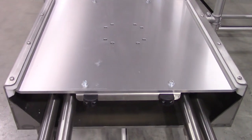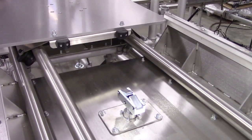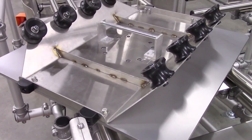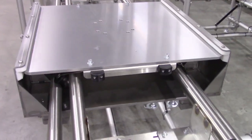While the cart and fixture were contained during the torquing operation, aft movement of the cart fixture was eliminated with a pneumatic lock. The cart was reinforced to handle the high side loads and also the combined weight of the rotating fixture and the product.